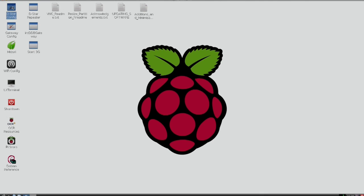First thing we need to do is run the D-Star config — it's got a nice little GUI. I went ahead and put my call sign in. Typically on D-Star, the B module is UHF and G is always gateway, and we set it up for Simplex because we're using the same frequency to transmit and receive on. All these settings are in the document on Goose's site. Some of the gateway ones are not — I will make notes and put those in the show notes. There's not that much changed here by default. Under Modem, the DVMEGA is fully supported, as well as quite a few other things including the DVAP.